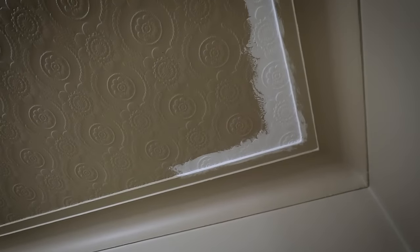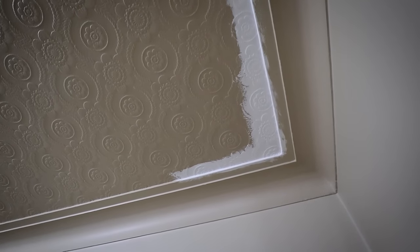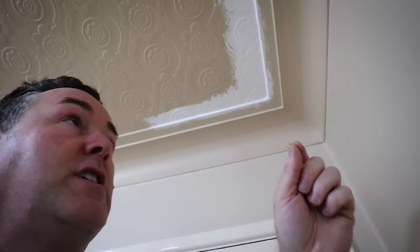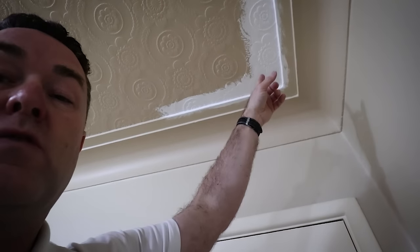I'll bring the camera in closer now that I've brushed that on - wow, what a difference! My dad's looking as well. Look at that - can you see the difference? It wasn't a white ceiling before, it was an off-white ceiling, but that for one coat on white is quite impressive. I've gone around and just feathered it off with the tips of the bristles so I'm not getting any brush marks. You could possibly get away with one coat, probably better if you were spraying it, but for one coat so far I'm quite impressed.